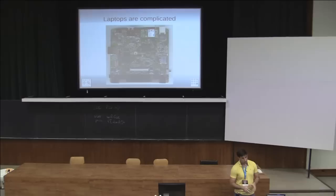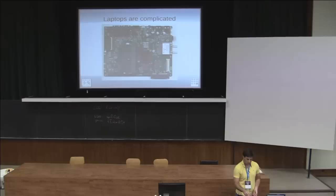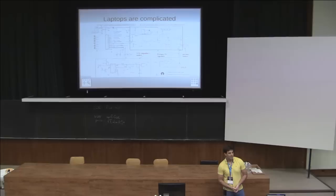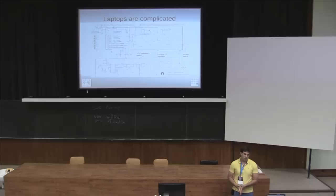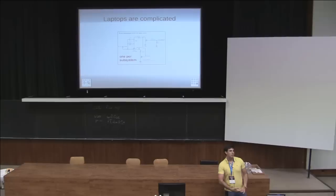The Covan board is a little more complicated — it supports a single 2-cell battery it can charge. Its input schematic takes about 9 volts from the wall, regulates it down, feeds it into the battery, and grabs the main board. Novena is more complicated: it takes anywhere from 7 volts to about 20, regulates it down, there's an under-voltage lockout protection, and there's a 3.3 volt rail in addition to the 5 volt rail. Because it's a laptop, each subsystem also has a power switch — for example a power switch for the audio chip, one for video, one for serial ATA.